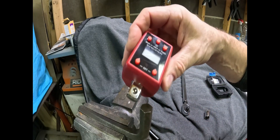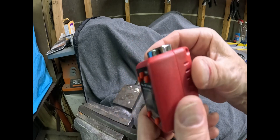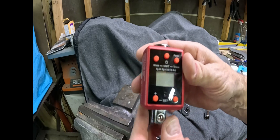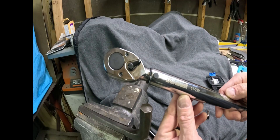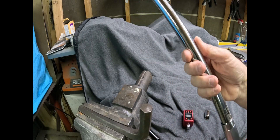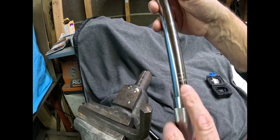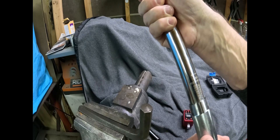Like I said, these are inexpensive — this one's triple-A powered. They have this one in half-inch but also quarter and three-eighths. I know a lot of people already know these exist, probably seen them on other YouTube videos, but it is extremely useful. I just learned something about my torque wrench — so when I go out to do the lug nuts on my truck or check them when I rotate my tires, I can set my proper torque and give it three or four extra pounds on the scale, and I know I'll be right on.